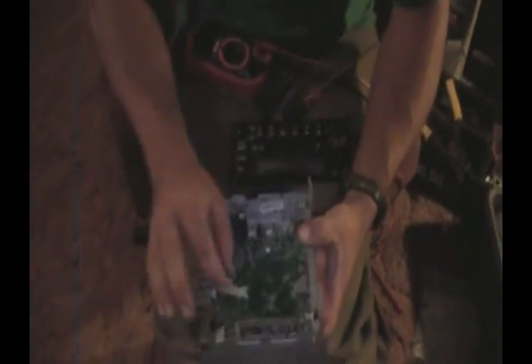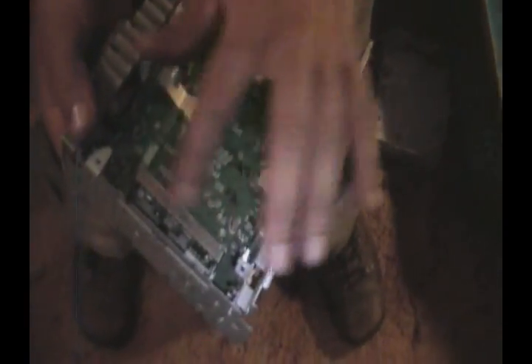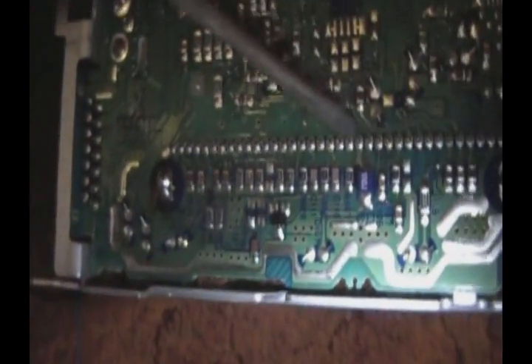Here's the radio slash tape deck pulled out. It's got that big fake front — I think there's room for a CD burner. This is the radio mostly disassembled. We've got the tape deck out and the face plate off. Here's our little metal box. Here's the antenna input. Basically the antenna comes in, the radio tuner box tunes into a radio station, and then it goes to these chips and through resistors to amplify it. We want to find where on this column of pins, coming from the radio tuner box, is the basic right and left sound. As you can see, there are no labels on here, so this will be a good test of my technique.